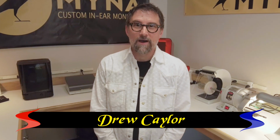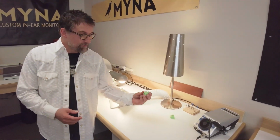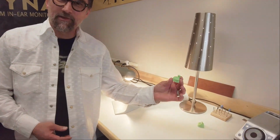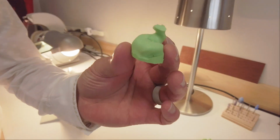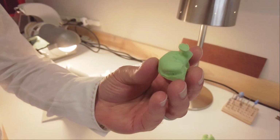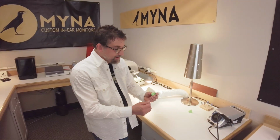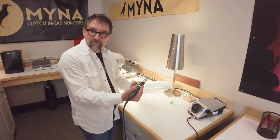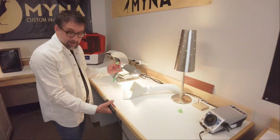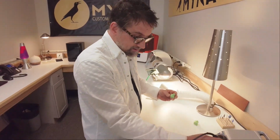Hi guys, I'm Drew Caylor. I'm the design engineer with Myna in-ear monitors. I'm going to take you through the process here today in the Myna Lab. The first thing that happens when we're creating a custom set of in-ear monitors is we get ear impressions from the audiologist, from the customer, and I take these and begin to do some rough detailing to the impression itself. I use various tools such as our Dremel and a bench grinder, and I shape them so that they fit comfortably for the customer.